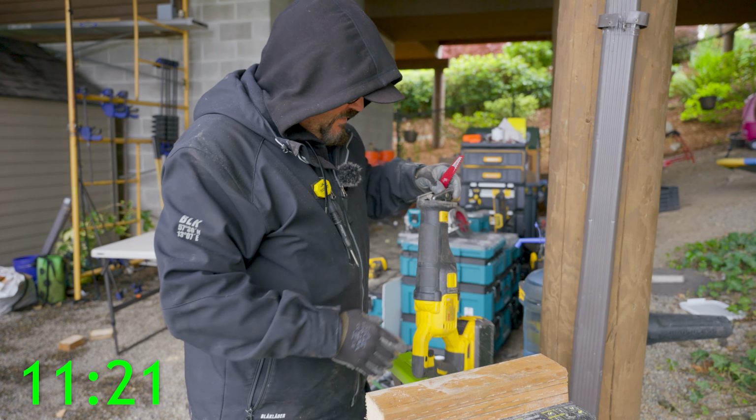Yeah, I would say that probably cut a little bit better and a little bit cleaner. It wasn't bouncing around quite as much. So that's a pretty good cut. I was about to give it up to the Dewalt saw until I made that last cut in this setting right here, where we're in a more advanced reciprocating cut where it's oscillating back and forth a little bit more. Instead of going back and forth like this, it's actually kind of cutting at a more aggressive stance. So I think that if you want the fastest, most aggressive cut, this is your way to go.